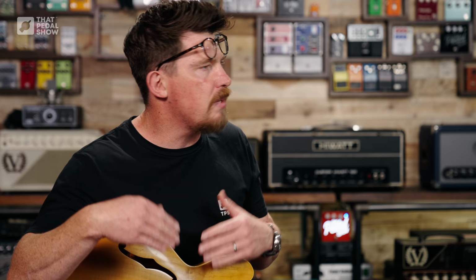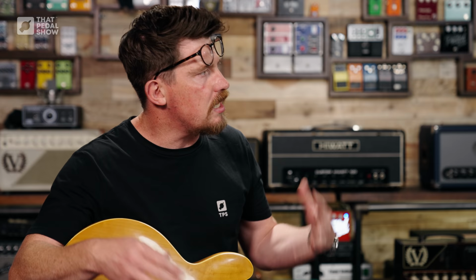One of the surprises on the Clockwork is there's no tone control for the repeats. Perhaps less required on an analog delay, although, as we see, the Suhr has it. You'd expect it on a digital delay or a modelling recreation of a classic character delay because you want to roll some of that tone off the repeats. So maybe it makes logical sense that it's not there on an analog delay. But when it sounds as clean as that, to get it to sit back out of the way, you'd like the option to roll a bit of that top off. Interesting.